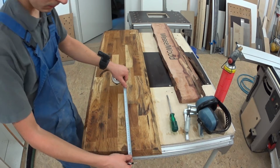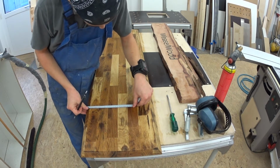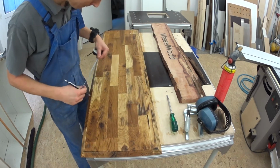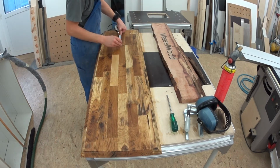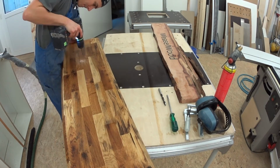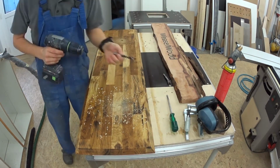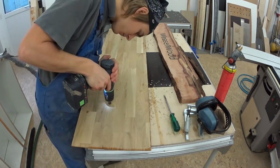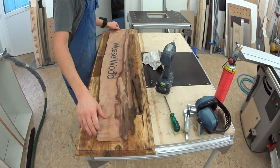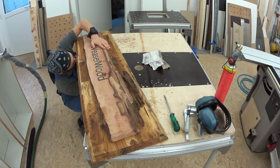I wanted to mount it to the wall, so I needed to drill 2 holes as hangers and 2 holes to screw the pearwood sign to the back panel. The hanger holes had to be sunken to snap on the head of the screw in the wall, so I pre-drilled them with my Forstner drill bit from the front. I eyeballed the center of the sign to the back panel and screwed it on.